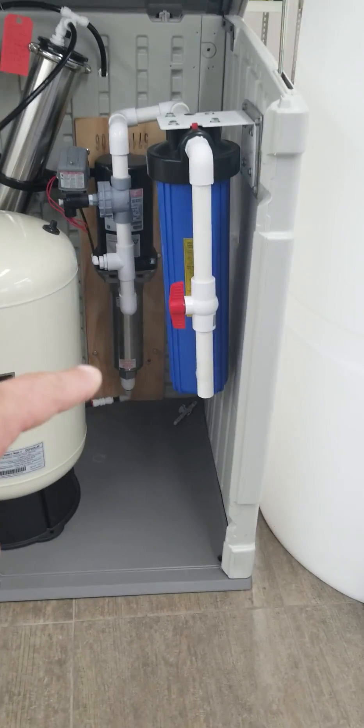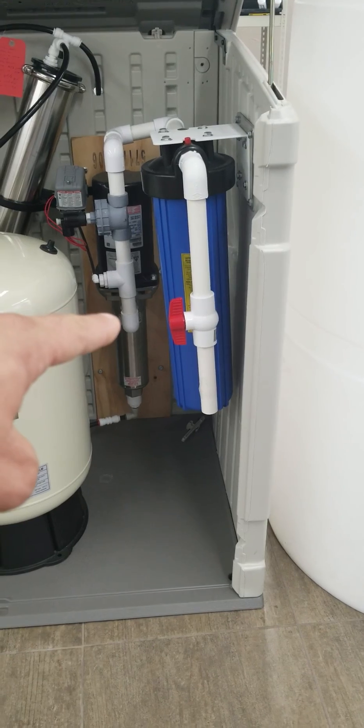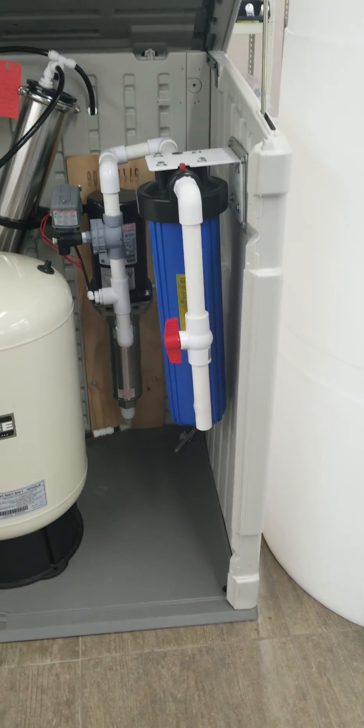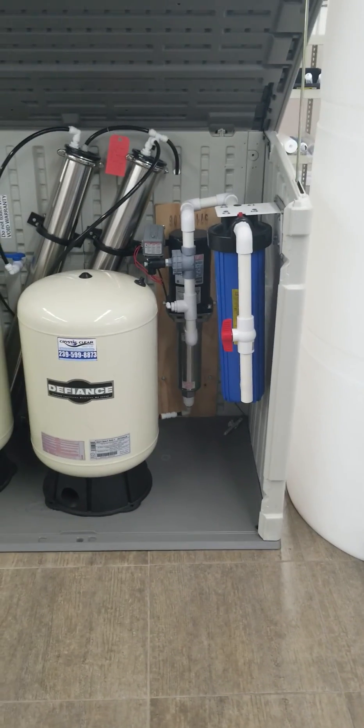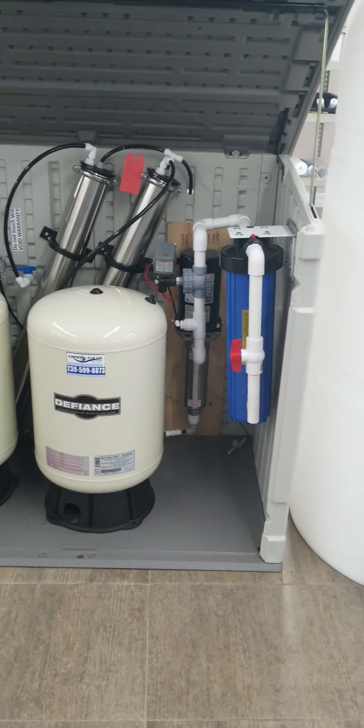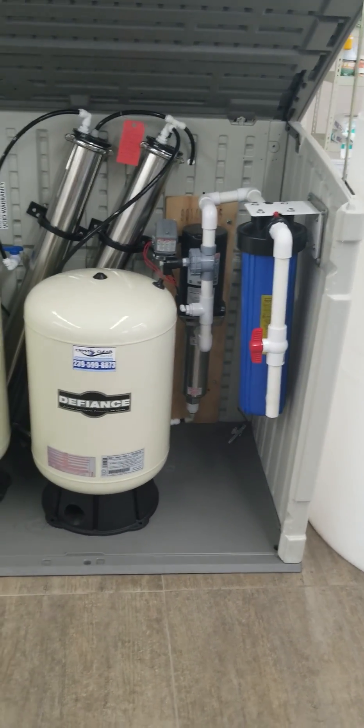As you can see, our unit here has a stainless steel pump with a long, skinny shaft — that's the shaft of the pump. That's the wet end of the pump, where the water goes through to get its pressure. If you don't have a long stainless steel nose like that, you're not going to get the high pressure you want. I'll show you some examples in a minute.